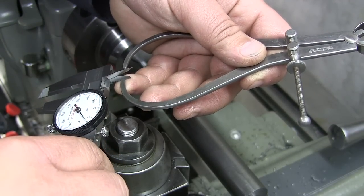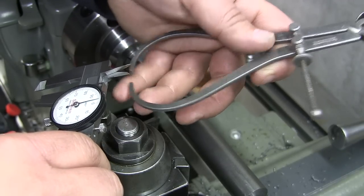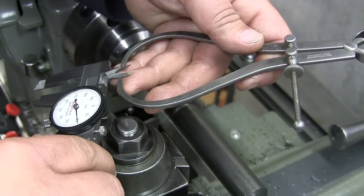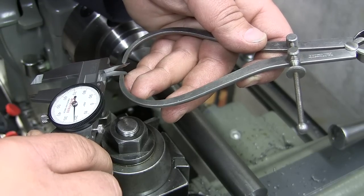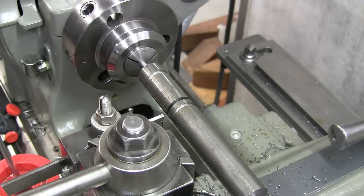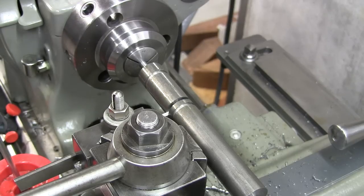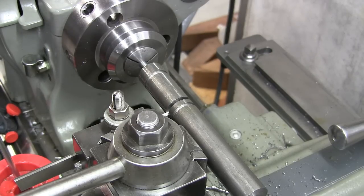Kind of tricky, and it requires a very light touch. It's something I'm not used to. All right, 421. Yep, 421. Exactly. Yep, 13/1000ths to go. So we're going to put this back to 100. We'll feed into 113, and we should be good.